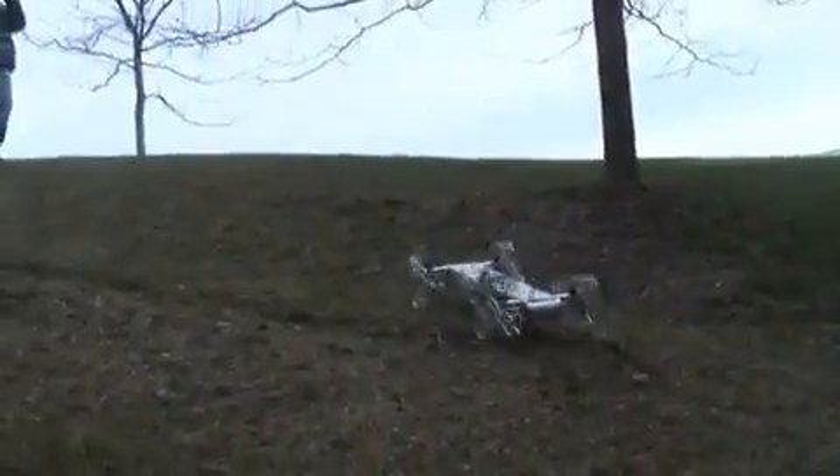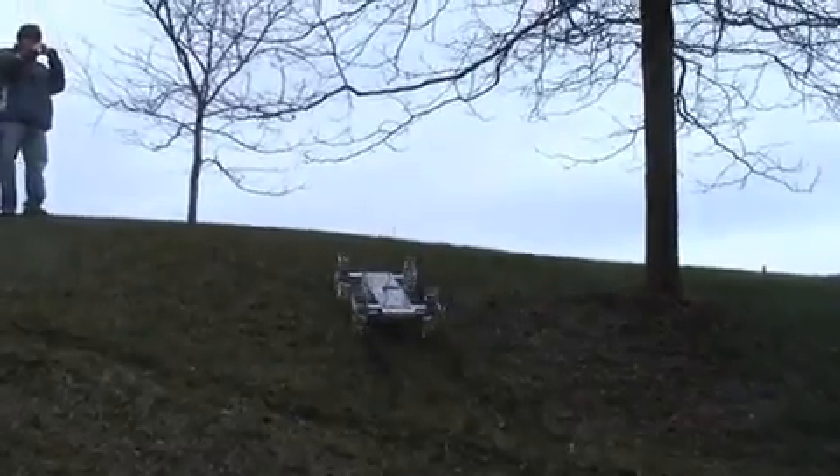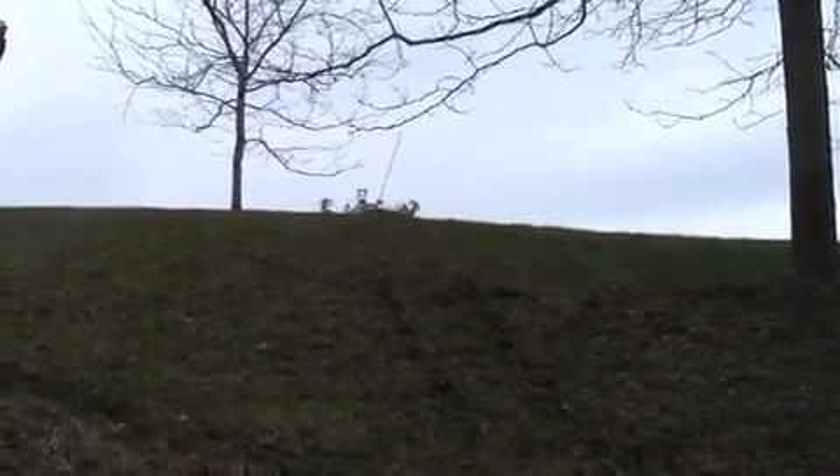The WEGS concept uses abstracted biological principles to navigate over rough and varied terrain with little or no low-level control. Torsionally compliant devices in the drivetrain of each wheel leg allow its gait to passively adapt when climbing large obstacles or steep inclines.